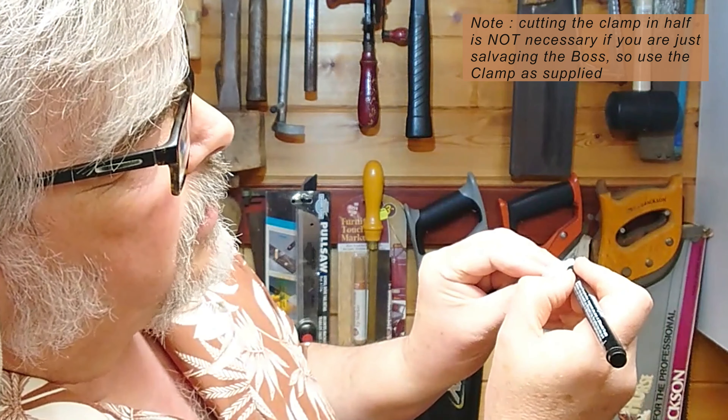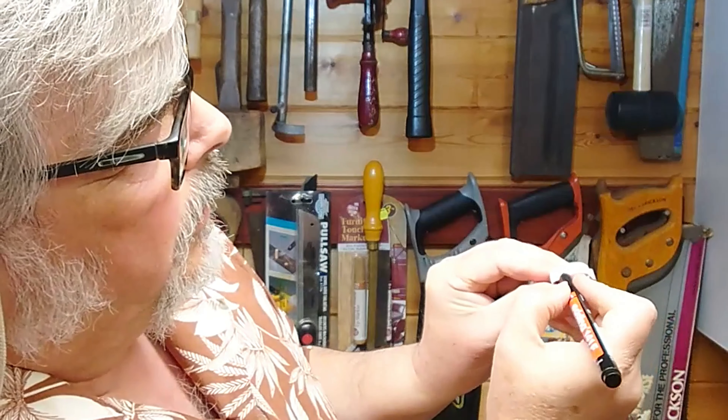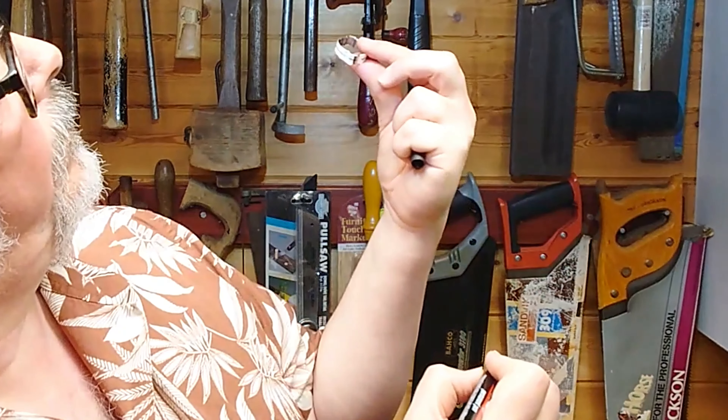That's the hardest part of this I think. So this one I did earlier — I bought two just in case I screwed one up — so I put a bit of white tape on it and by eye just marked around the edges. What I'm going to do now is join it up and use it as a guide for the slitting saw to cut it in half.